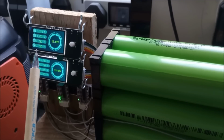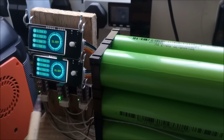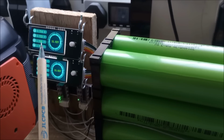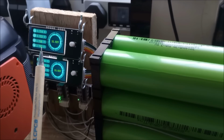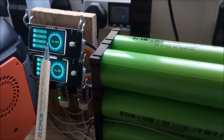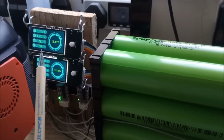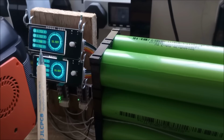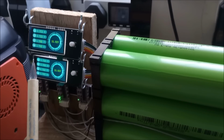You can see the individual cell voltages, but I'm not 100% sure that these are completely accurate, because the balancers, they're very low power balancers, should be bringing the cells into balance. And I keep seeing these 2 cells, which I think actually are the most positive cells, are significantly higher. Well, I say significantly, I'm looking at the 3rd digit. It'd make more sense if these were just 2 decimal places, because you do get very distracted by this 3rd digit. They're all 3.75, but this is 3.754 or 3, and this is now 3.760.